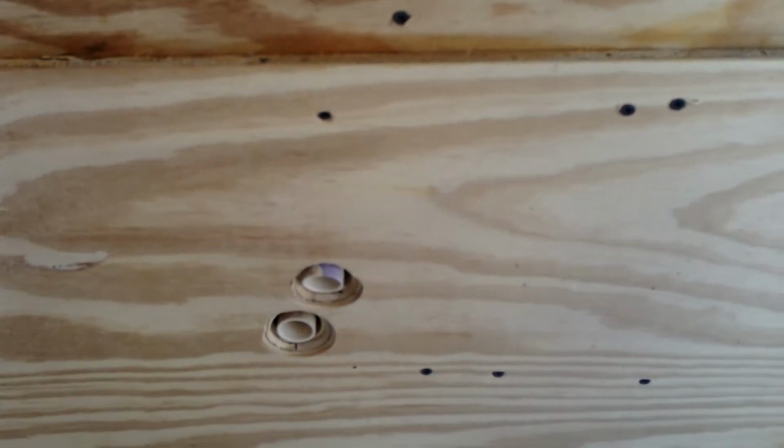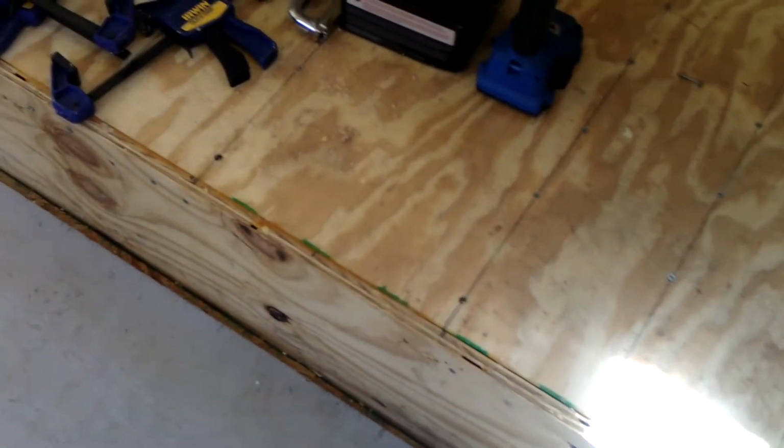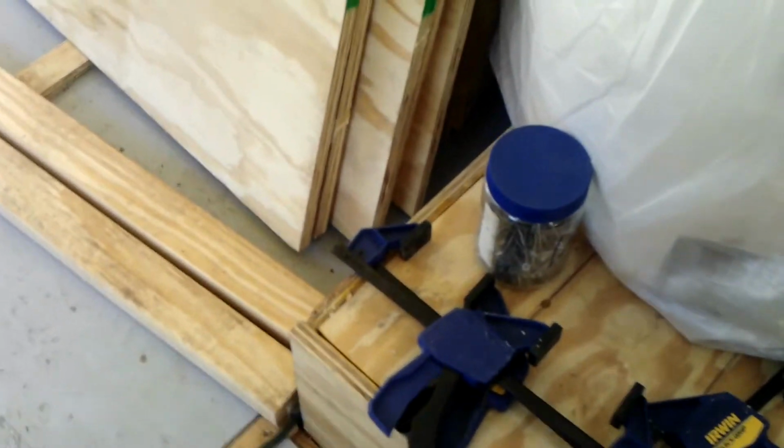So that's where the water for the sink, and then the drain is going to go down behind the refrigerator, out this way. There is a pocket, sorry for the shaking. It's going to run here on the outside, in between there, down, slowly angling down about an inch for every 2 to 3 feet. So maybe a little more than that. We'll see how much we can get. And it's going to go that way because the drain is over there buried. You can't see it right now. But that's where we're at.